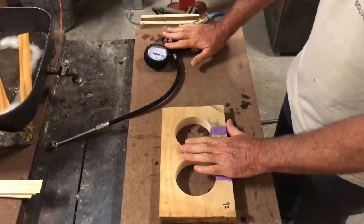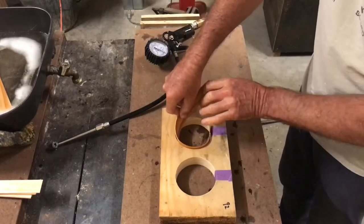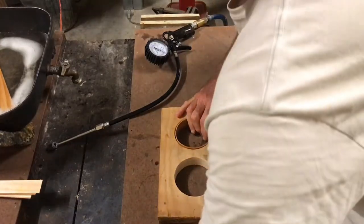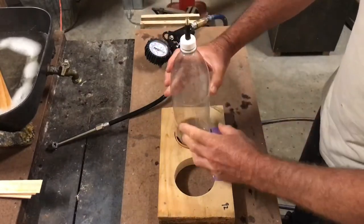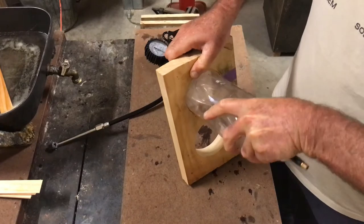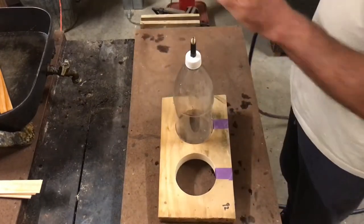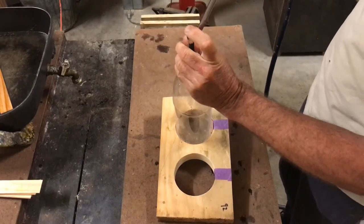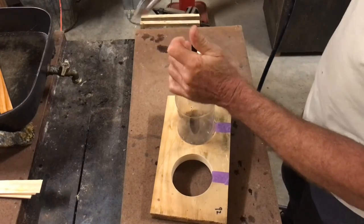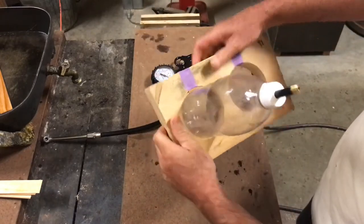I've got my timber mold ready, my tire inflator ready. All I need to do is reach over, grab one of the timber strips, push it into the mold, press it down nice and flat. Just stretch it out a little bit. Reach through and grab one of the bottles, loosen the pressure off, push it in. What I have to now do is turn it through and push it through about 20 to 25 millimeters. It's just about right. Tighten the cap and then just inflate the bottle slightly, and as you can see the finish around the outside is very good.